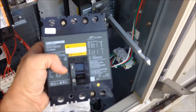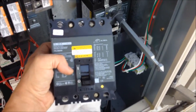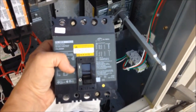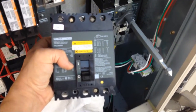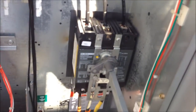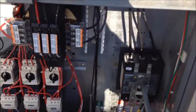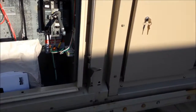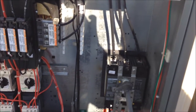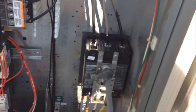I'm going to get this in here, check the motor and everything, make sure the windings aren't messed up, make sure it didn't single-phase. If everything's a go, I'll go downstairs, put my fuses back in the main disconnect and switchgear, and get this bad boy running. Got the new one in there, all hooked up, wired up tight, ready to turn it on. Let's hope everything is good and I don't see any more sparks. The motor checked out good.